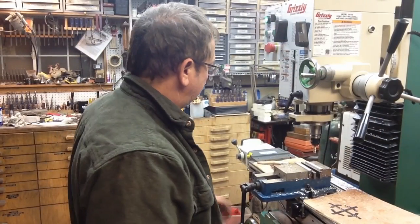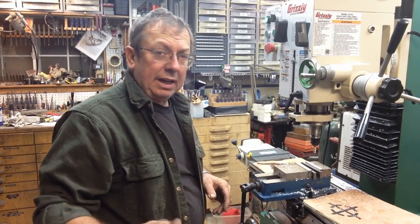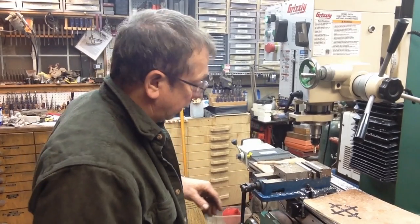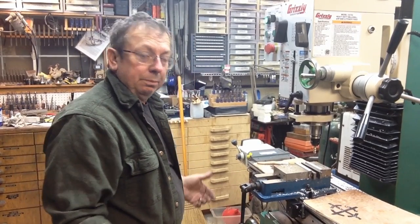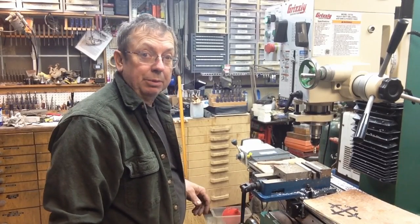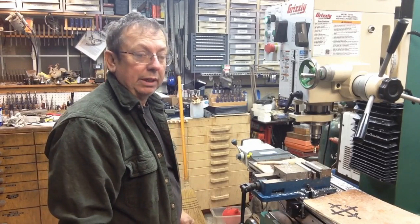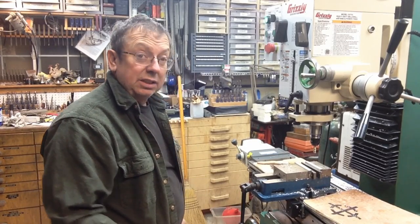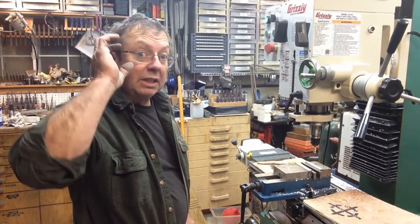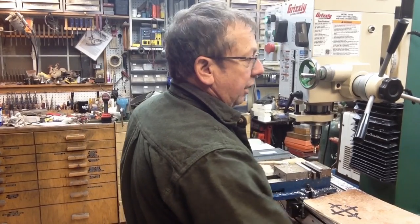Alright, well, I've been machining the brackets for the back of this, which has been what's going on, but I had to take a little detour. I had to raise the mill up a little bit, another 3.5 inches. I knew it was too low before. We had it on some 4x4s down underneath, and all I've done is cribbed it up on another pair of 4x4s. So, in essence, from the way it was shipped with a 34-inch table height, we've raised it about 7 inches since then.